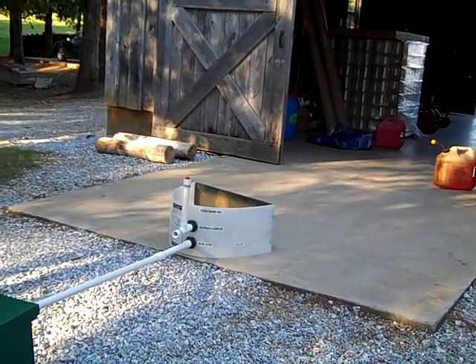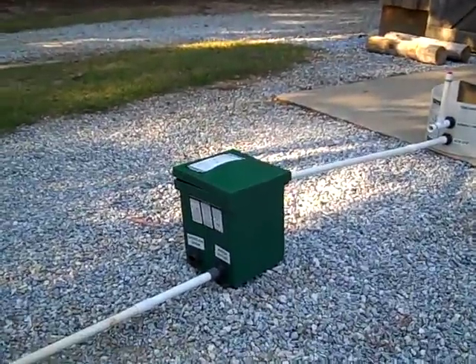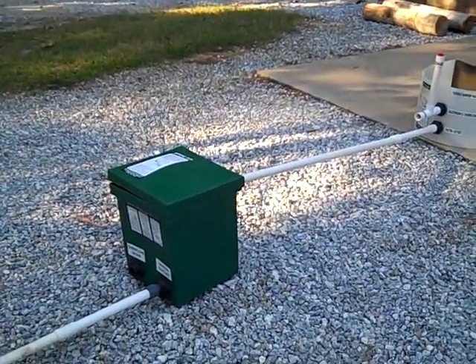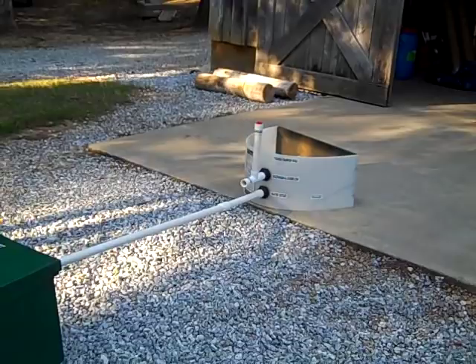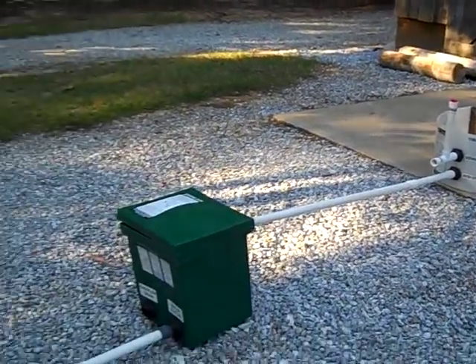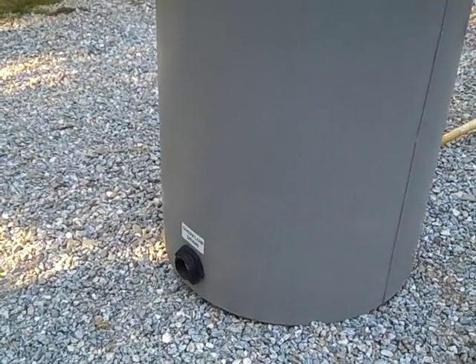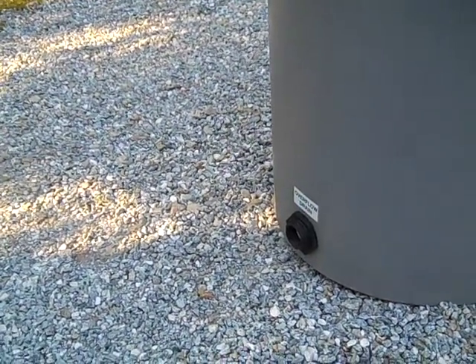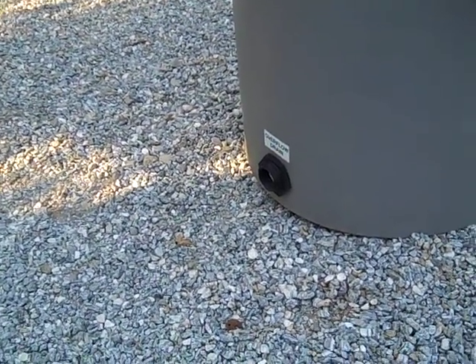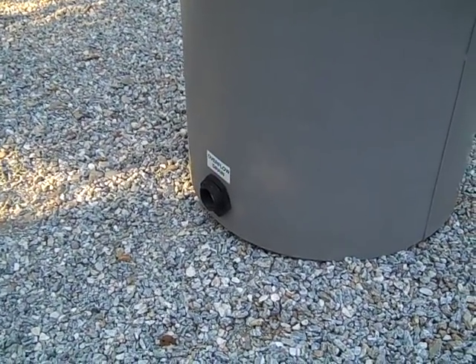The collection system will be completely buried except for that backwash tube. Once it's flowing, the spring box will not freeze because the water is constantly moving — where I'm installing this the water is about 58 degrees, well above freezing. From the tank there's a large overflow, and on this first installation I'll be running to a ram pump. If not a ram pump, you can hook any pump — a SureFlo, any DC pump — to the overflow and pump it wherever you want. If all of this is above your home, you can gravity-feed to the house and adjust pressure accordingly.